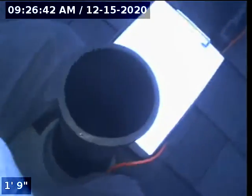We're at property address 482 Southwest Laurel Road in Estacada, here for a sewer inspection. Point of access is a 3-inch ABS roof vent. We have water running from inside the home. We're in the horizontal position. We're going to zero off the foot meter and then continue with the inspection.